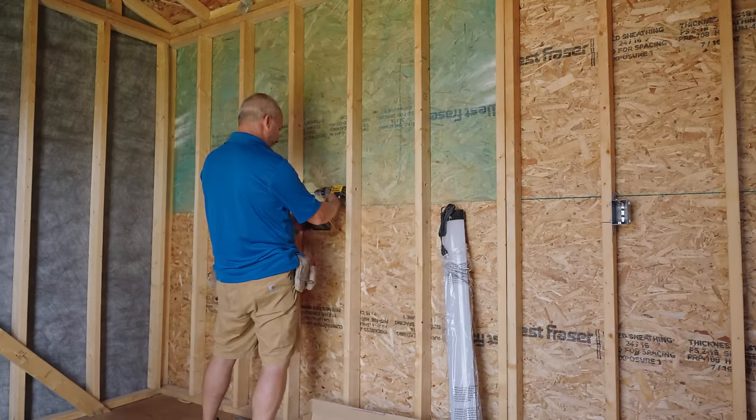Okay, now we're gonna get the face sticking up the right way again. Put a bend in the bottom of the box, bend up here, another bend going down, and another bend going up. That way everything pushes to the back of the box, because this ground wire, you don't want it ever coming around the front with power. It'll short it out on you. So that's why we do the S.